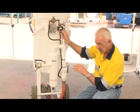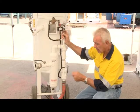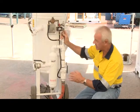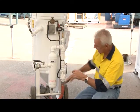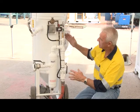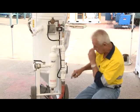So this pot here is slightly more responsive in relation to the dead man actuation. Because when I open the dead man, that means I've got air there immediately. It doesn't have to shut the pop-up valve, build up pressure and then start to work down the pusher line. That means that when I open the dead man, there is positive pressure there all the time.